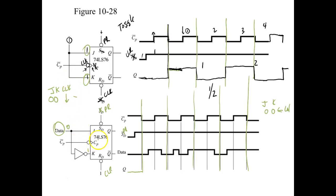So we can latch it two ways. We can bring the clock high. So if the clock is high, it's going to latch it, right? Understand? But here we got a what? Here we got a 1 on the J, a 0 on the J, a 1 on the K, and then we have this clock. So the K input clears it. The J input sets it. So you're right, it's going to stay low. It's going to stay low.